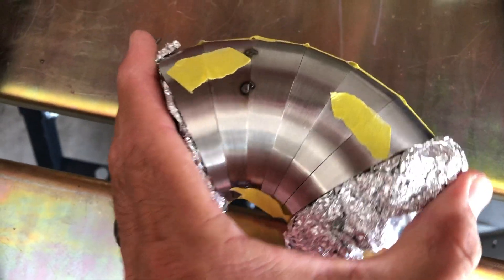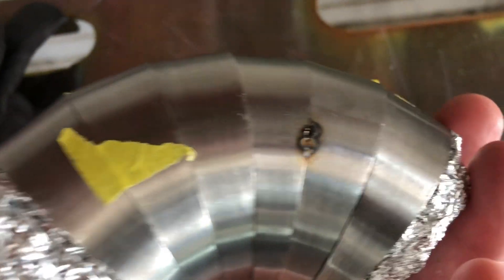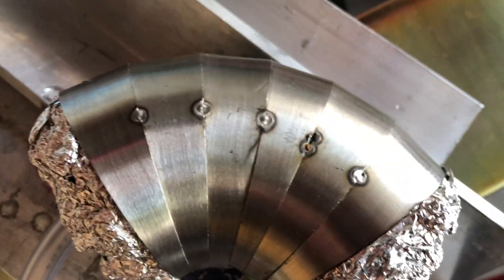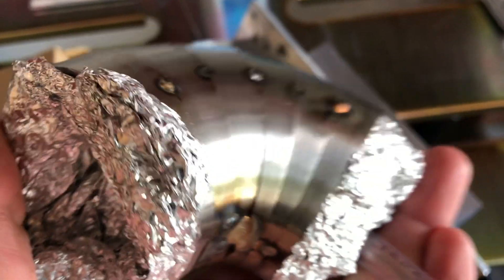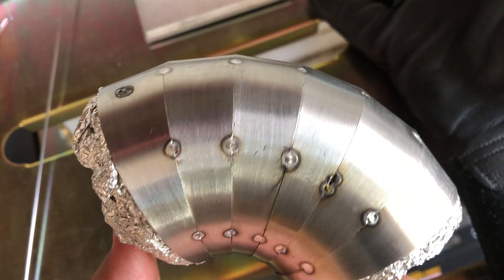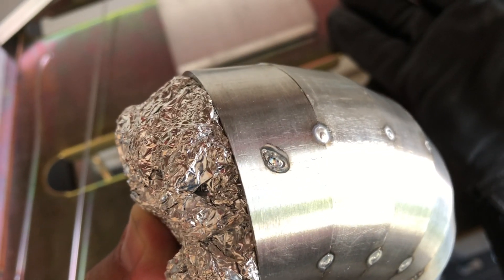I have some tape holding up some pie cuts. I was trying to get some tacks going around but it didn't really work out all that great — rather low amperage and rather high hopes. I used a little bit of tape and upped the amperage a bit afterwards and this is what I got, which was considerably better. That was my very first attempt. I'm not ashamed, it's all learning. I won't be doing that again. I added several more tack welds all around after noting that little gap at the bottom.